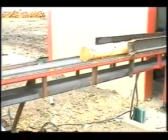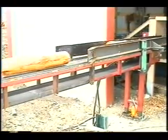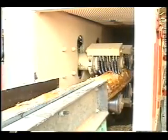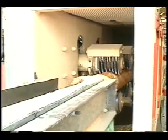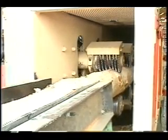Roundwood Systems does offer in-feed and out-feed conveyors as optional equipment. Here you see the logs as they enter the dowel mill. The first set of feed rolls will open when the sensor detects a gap. The sensor is located between the first and second set of in-feed rolls.